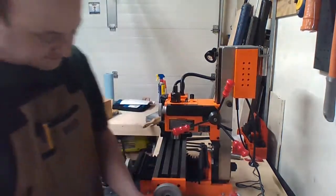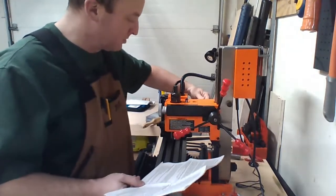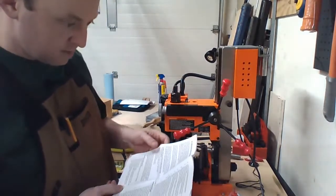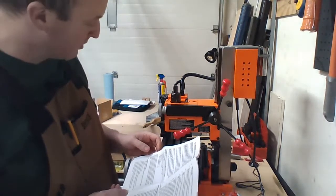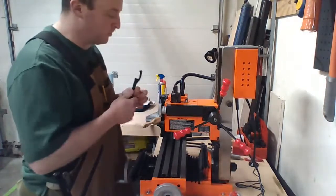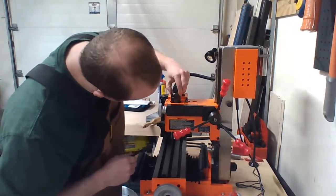So, mill head's down. Move the speed range selector to the high position. Sure, it's in the high position. Cut the plastic cable tie. I did that already. Loosen the set screw, 3mm wrench, inside of the spanner nut on top of the spindle. So I think it's going to be this guy here. This is going to be greasy, so I'll try to use this to find it. There you are.